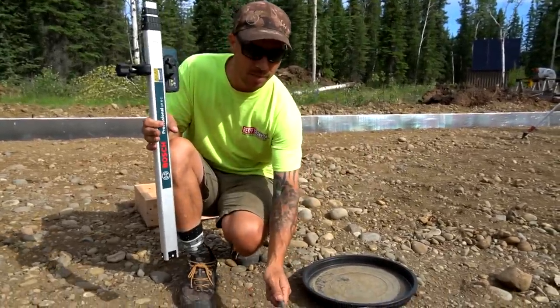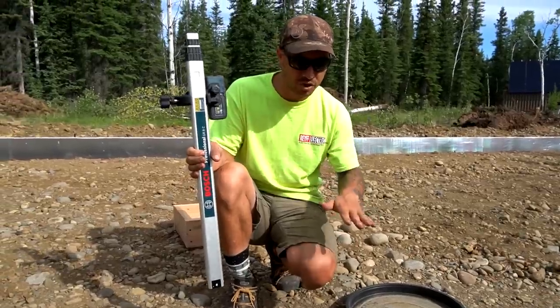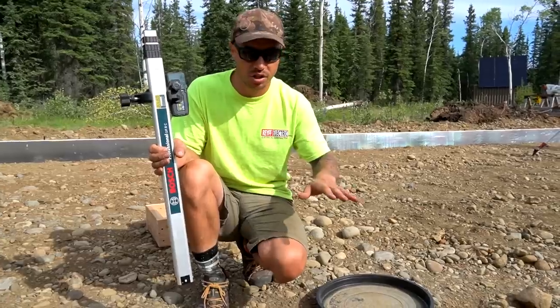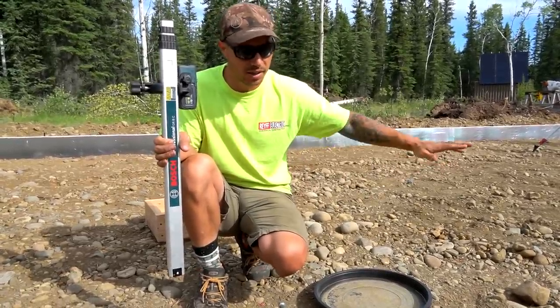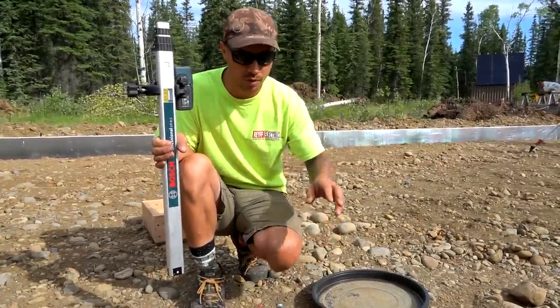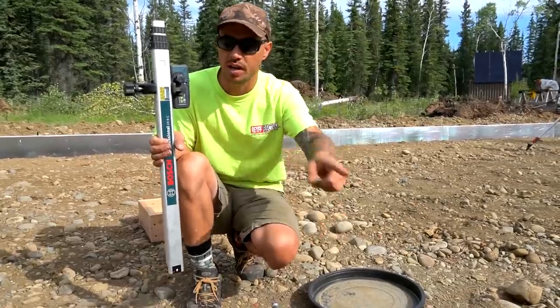We've got our drain on top. The next thing we need to do is make sure we have this drain in the correct position in the concrete floor. We want a slight slope in our concrete that will lead water into our drain, so we're going to do this a half inch lower than everything else.